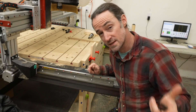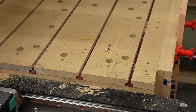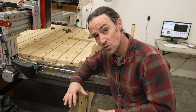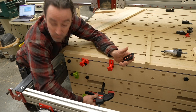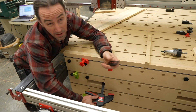My general idea was the same as my spoil board design: one base sheet of MDF with T-tracks on top, and then some MDF slats on top of those to hold the T-tracks down even stronger to prevent any pull-out. I really like using T-tracks, and for this project I spaced them out five inches — the same as my regular spoil board — and that seems to work pretty well. Frank's design heavily relies on clamp holes; I put a few in but didn't go too crazy. I did a square cutout which fits the head of all my clamps.